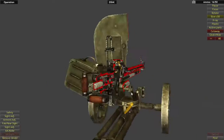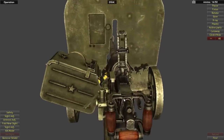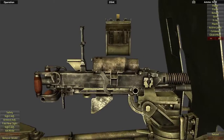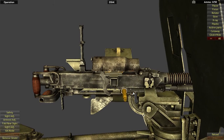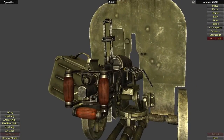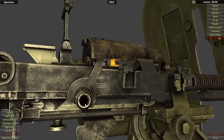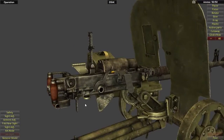You can see the fire controls back here — just a pretty standard spade grip with the trigger here. Right beneath is the charging handle. When you reload the gun, they would generally take a spent shell casing and put it in the actual charging handle to rack the slide back. They did this mostly because with the spade grip at the very bottom it didn't always work, and it was much more reliable to put the case on the end of the charging handle and rack it as if it were a normal side-charging machine gun. You could also use the bottom spade grip if you wanted.